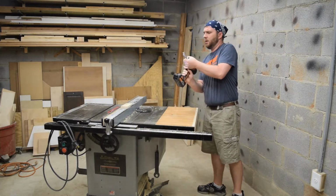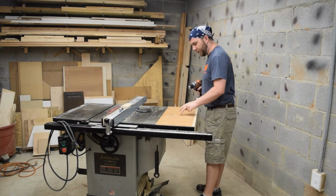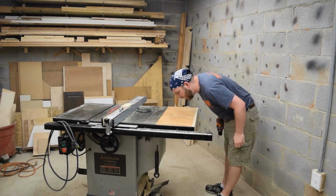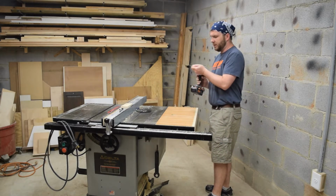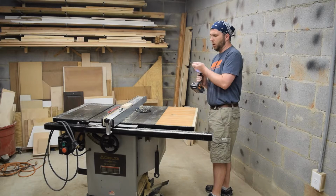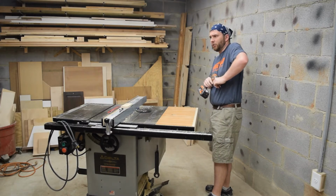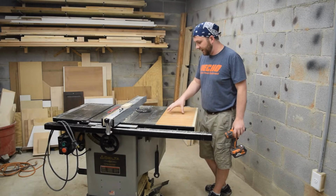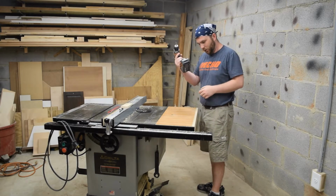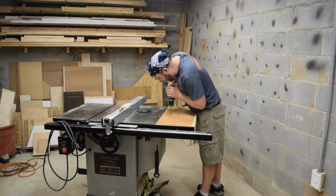Now, I need to drill the three outer spots where I've already recessed for the bolt to go through. The pilot hole was to center for the countersinking, and now I'll also use that pilot hole just to center this going all the way through.